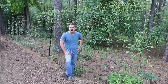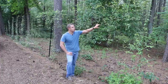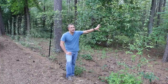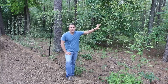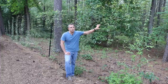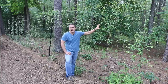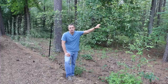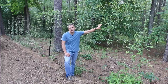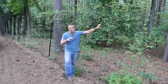The project I'm working on today is installing an 8-foot tall metal deer fence, like the one behind me — this is what I put up last year. It's an 8-foot knotted wire in black, all metal: all the posts are metal and the fence is metal. It does a great job keeping out deer, but you have to go all the way around. I've got about a 120-foot run on this side, and we're basically running across the front of the property. The final step will be building an elaborate gate for the driveway that will be powered and all metal.